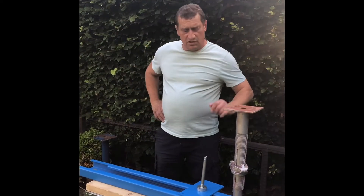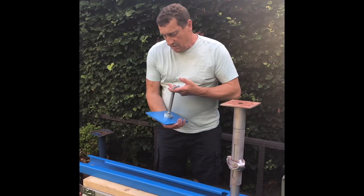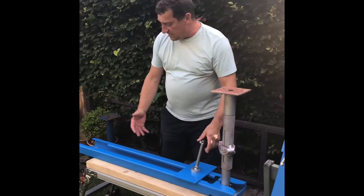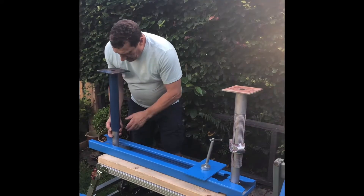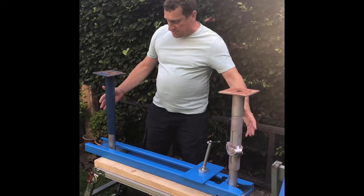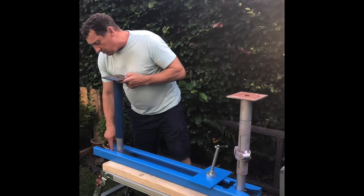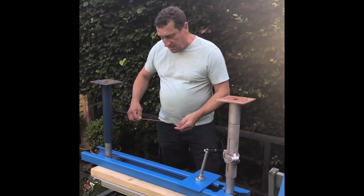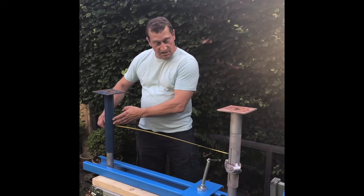The new model can still be used like a standard needle by placing a prop at each end. As with the old model, you remove the jacking screw plate or the adjustable foot — and the difference this time is that rather than being fixed in position, if you're stuck for space you can actually slide it along and move it to any position you need, while still being retained by the threaded boss at this end.